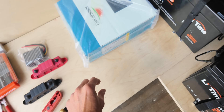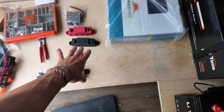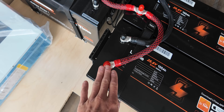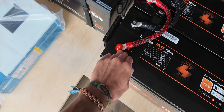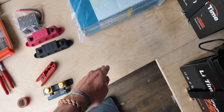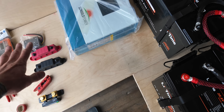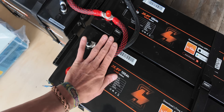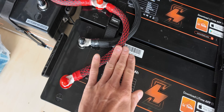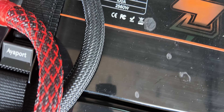What we'll be doing next is taking a negative lead from this battery and bringing it down into the shunt, into the negative bus bar — from there it will distribute to all components including the inverter charger. Then we'll pull a positive from this side into our primary fuse, into our on-off disconnect switch, and then into the positive bus bar which distributes to all components. That'll be a step for next time. In the meantime we'll let these batteries balance out — the wire loom really dresses it up nice and gives the positive and negative wires a more premium look.